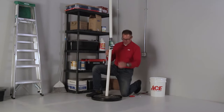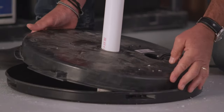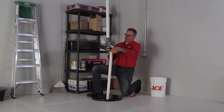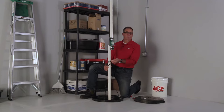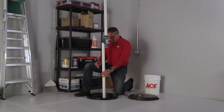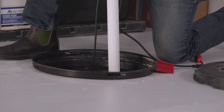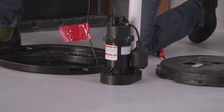Now the pump is disconnected, we can take the lid off of it. Remember that many times a sump pump may or may not have a lid, so I'm just going to pull this off the top and move it aside. Once that's disconnected you may get a little dripping water — that's okay. The pipe should hang so the water goes back into the pit. Then firmly grab the cord and the pipe connected to the pump, lift it up a little bit. There's probably going to be water at the bottom of the pump, so pull it up and out of the pit and set it down.